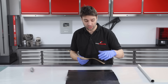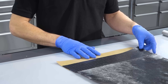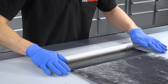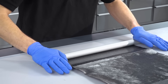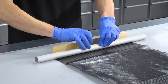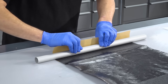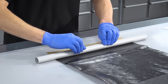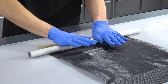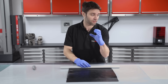To get the material started onto the mandrel, use some of the release paper off the back of the prepreg under the first section. That will allow you to take your mandrel, firmly press down, and if you rock back and forth it should tack it down onto the mandrel. You can lift the paper just to help it along, then firmly press it on. Once it's started, it's very important to keep a really positive pressure all the time, pressing the mandrel down onto the material to ensure that it wraps very tightly.